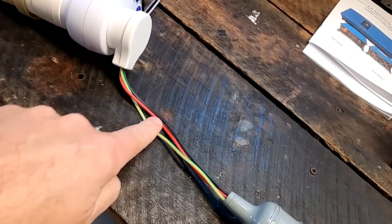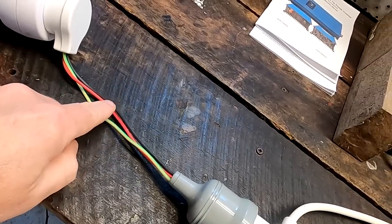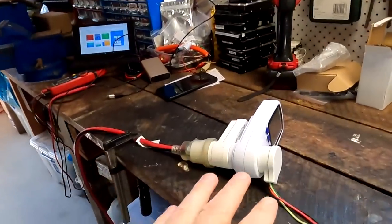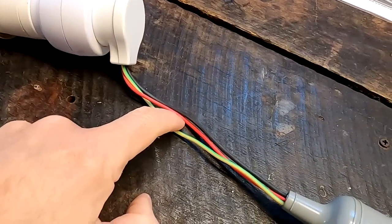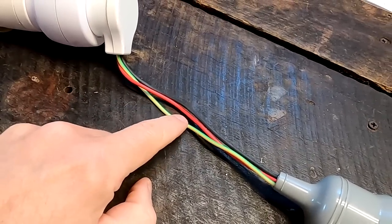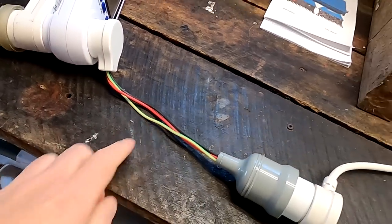I have split up this cable here to enable us to connect the limiter sensor later on. This is what you have to do in your meter box — connect the clamp to one of the cables which goes to your phase, to your active, to your supply to the house. This is a single phase setup: we've got one active which is the red one, the black one as the neutral, and the green-yellow as the earth. This has already been done in your meter box for you.